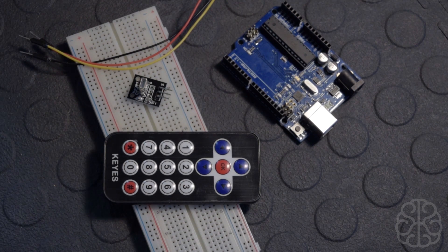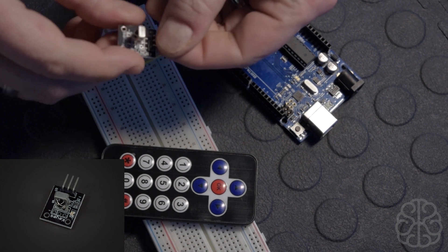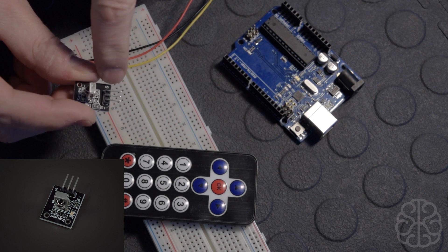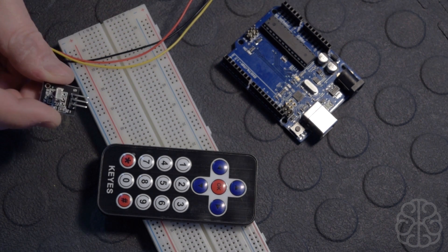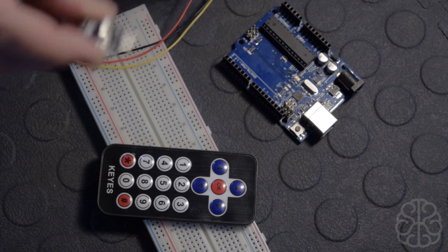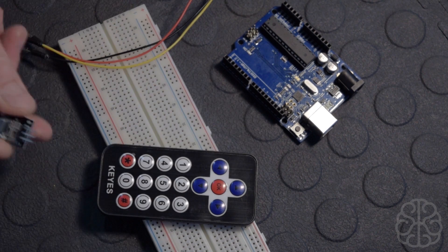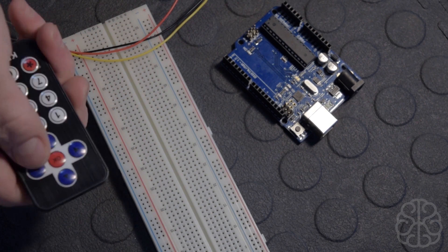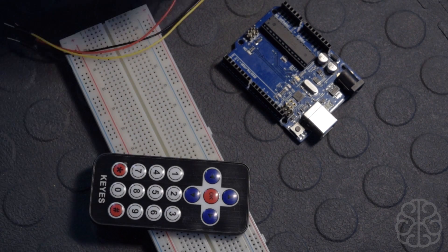Welcome back, my name is Ivan from Brainy Bits. Today we're going to learn how to use one of these little IR remote controls. We have a little IR receiver on a breadboard that only uses three pins: the negative pin, the middle pin is voltage, and the last pin is signal. We'll plug that into our UNO and program it with code designed for this sensor using a library. These little remotes are great for controlling something at a distance — this one has direction keys so you can go forward, backward, left, right, turn on lights, or enter codes.